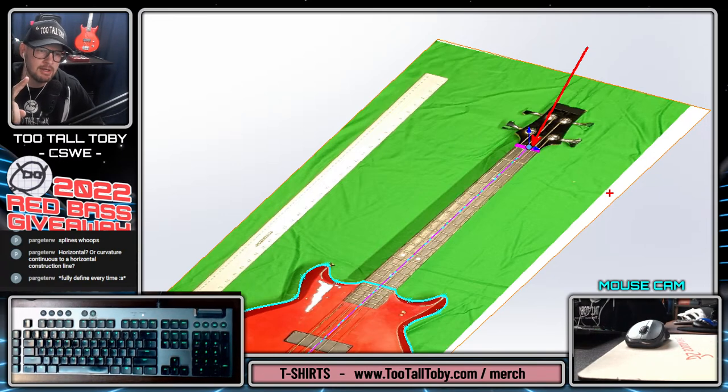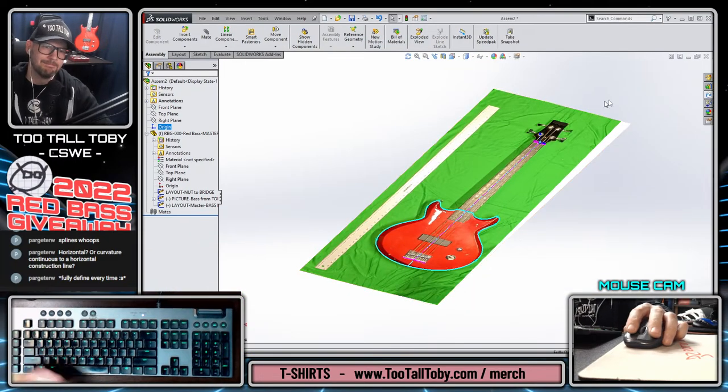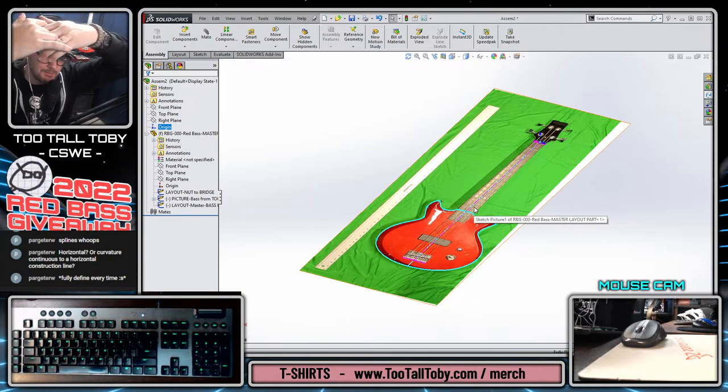Very important that the origin is the same on all of your parts that are driven by the layout. In this case, the parts driven by the layout are probably going to be, I mean, really, it's probably just going to be the body and the neck. I don't know if there's really any need to have any of the other parts. Those are the only two parts that are really significantly interfacing with one another. You might make the argument that the tuners could be part of that design or even the nut. But those are all pretty much off-the-shelf parts. It's not important that they fit together the way it's important that the neck and the body fit together, because there's actually an interlock between the two.